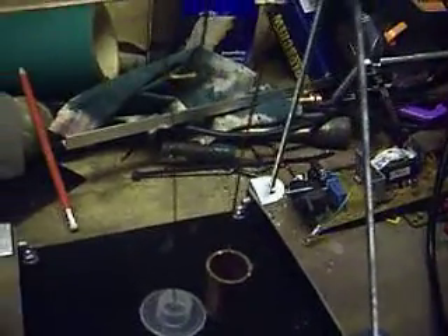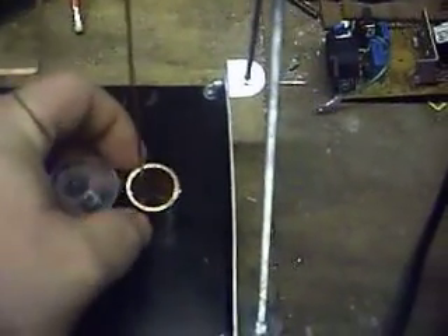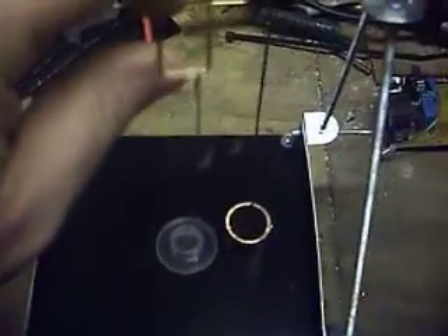Same material as the crankshaft and the power piston rod. I'm also going to need to create some sort of joint for both the displacer and the power piston, basically because of the offset in the crank — it pulls things over a bit too much and generally doesn't like it. There's not that much friction on it, and as you can see, the weight of the CD itself quite happily pulls it down.